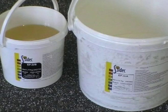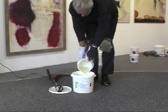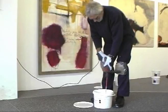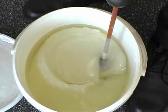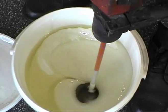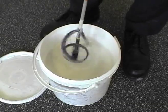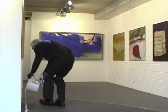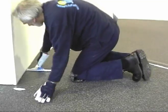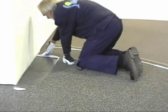Once the installation of the quartz system has fully cured in 16 to 24 hours, your floor is ready to use. We do, however, recommend a polyurethane top coat to provide additional wear protection and to protect against UV color fading. For areas which are susceptible to spills and contamination, such as kitchens, bathrooms, toilet areas, or floors with a smaller, 1 to 2 millimeter granule size, we recommend an application of our single component pore fill compound. This can be installed with a wide blade rubber squeegee.